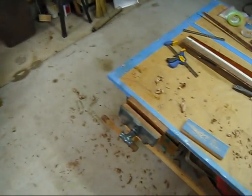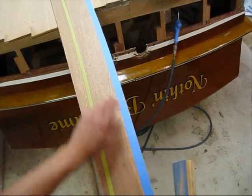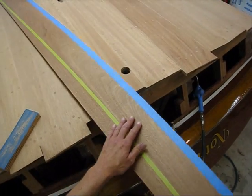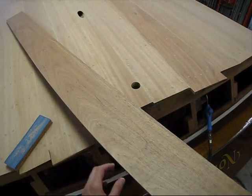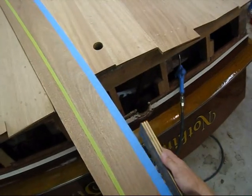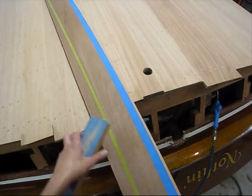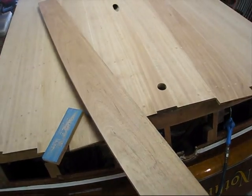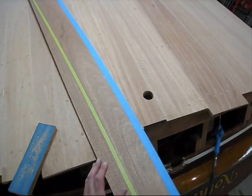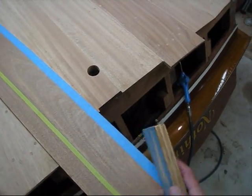Then I'll take a hardboard with 40 grit and 80 grit — I'll take the 80 and smooth that arc out. The sandpaper helps smooth it out. With this plank there's a lot of figure in it and the grain reverses, which really helps to dig through. If you were to take that plane on a piece of wood like this when you're pretty close to the line, there's a good chance you're going to take big gouges out. On other pieces of mahogany the plane will be just fine, but on this one I had to take it over to the spindle sander and work it down just about to the line, and then sand it in.